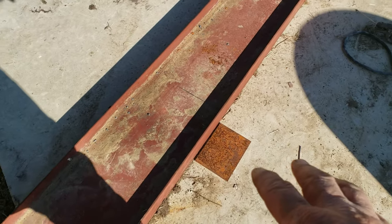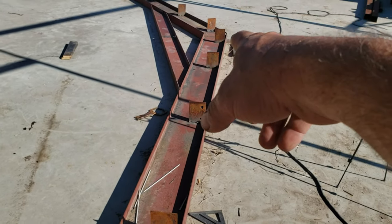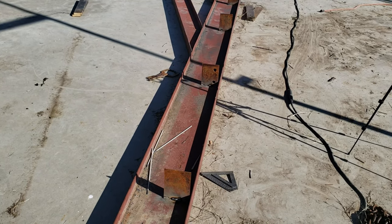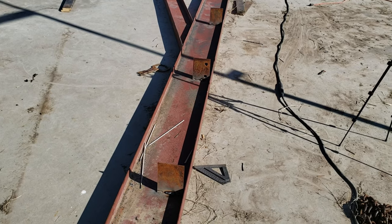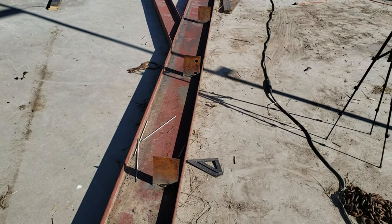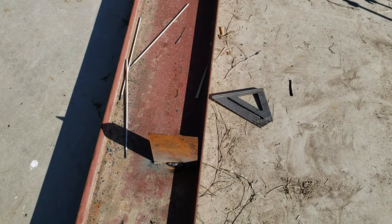So then the other way, if you don't want this I-beam, say you got a low building, you're only building at 8-10 foot tall or something like it, 12 foot tall, and overhead space matters to you, you can do like I'm doing and clip them in with C purlin down on the sides, and that tucks your roof more down onto your I-beam, and it carries the load and disperses it even on both sides, so it still works out really good. So I know I want them recessed in like this right here.